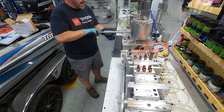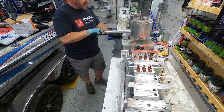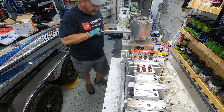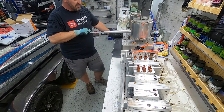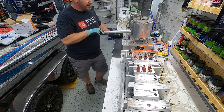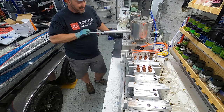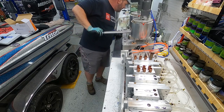And as I said before, you've got to warm up this tube. Although there's a heating element where the tube rests, you got to get it warmed up. Plus this helps purge any air that might be in the tube or in that heating block in the middle between the two pots. So I do this a few times just to get that tube nice and warm. Then I'm going to inject probably one bait just to see what we got.